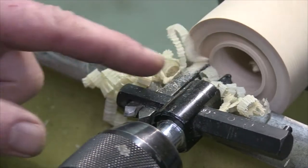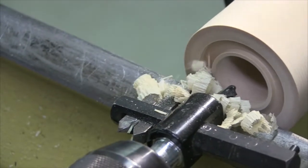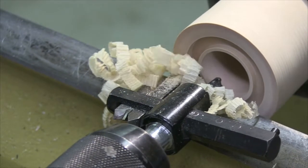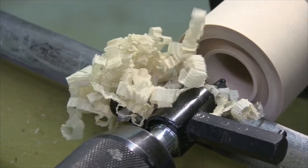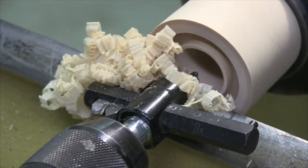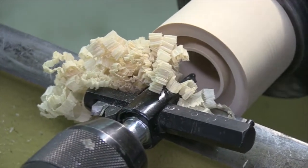And since we don't have a center point for the drill to ride on, we're riding it on the tool rod. How deep do you want it, Ray? Oh, it's best to leave the center solid. Yeah, because then the drill point will ride in the center and support it. Yeah, I just wasn't thinking about that at all.